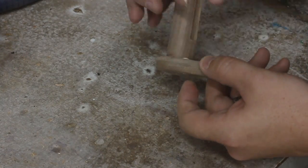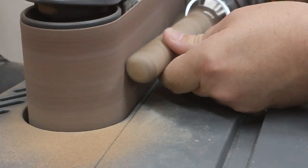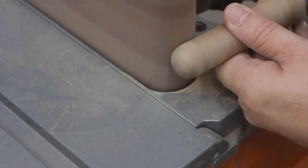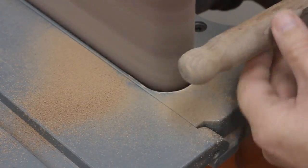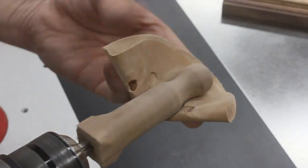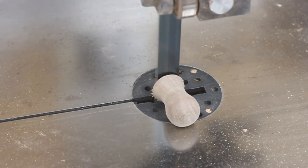The only piece left to make was the knob. And since I don't have a lathe, I'm forced to be a little creative. I chucked the dowel back into my drill and started to shape the end of it on the belt sander. Once I got the end rounded over pretty good, I switched to the other side of the belt sander and began to shape the underside of the knob. It didn't take too long before I had it shaped pretty good on the sander. Then I could use some finer grit sandpaper and really get it smoothed out before I took it to its bris for the old snippety-snip. Mazel tov!